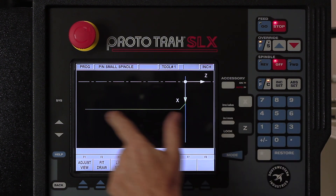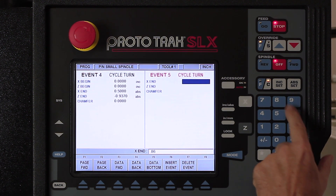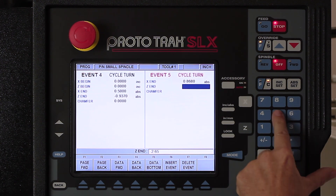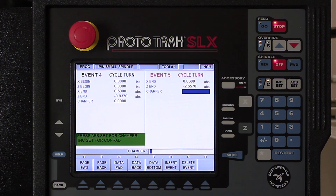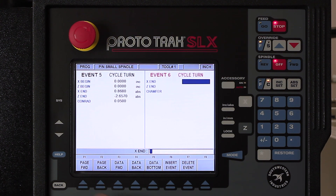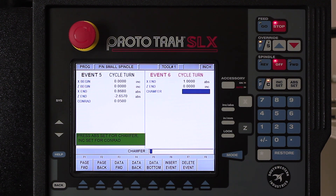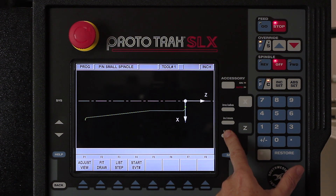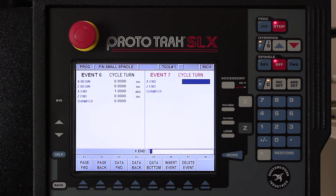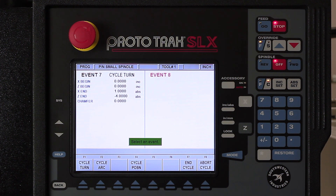When I push look you'll see it's starting to develop the part. Next is the angle part — still just a turning event. My diameter goes to 0.868 and my Z dimension is minus 2.657. The print calls for a 50 thousandths radius in the corner at the end of this angled line, so I'm going to put 0.05 and this time using the green box I'm going to use increment set to get the Conrad. I've got one more turning event to bring me out to my full diameter of one inch. My Z is not going to change, so I'm just going to use incremental zero, which means don't move it from the last Z dimension. There's no chamfer here. Now you can see most of the completed part — all I have left is to keep the one inch and go to negative four, which is the total length of my part.